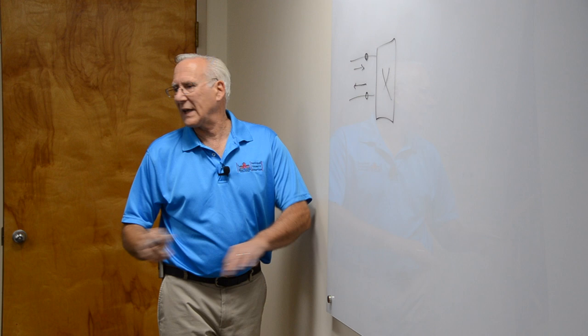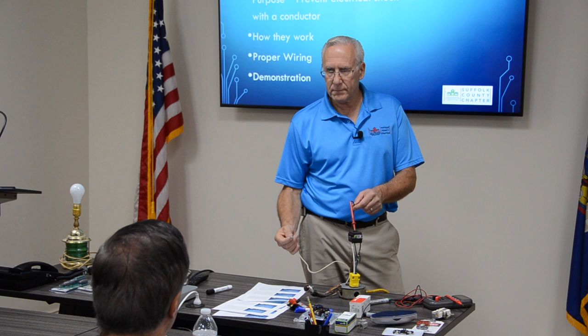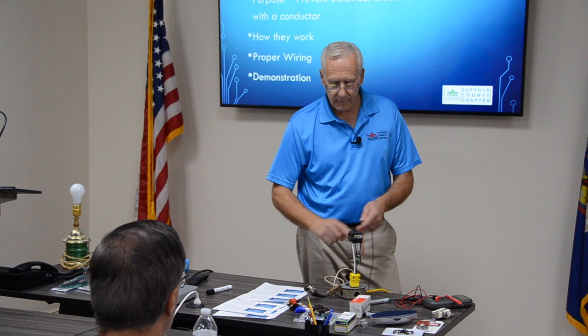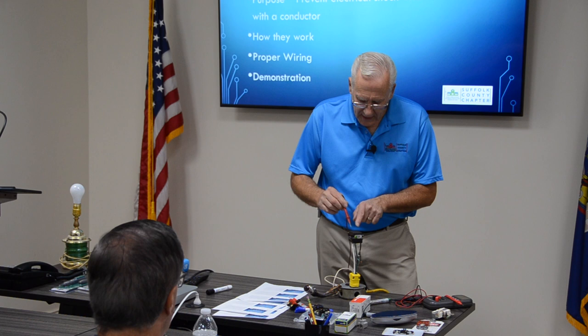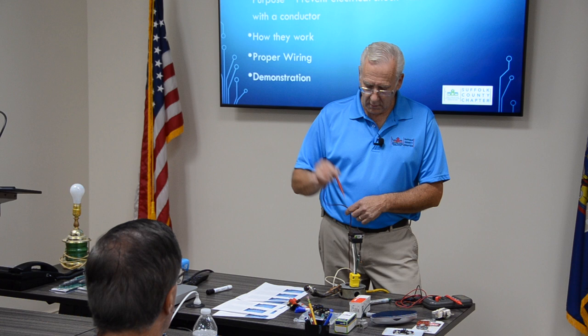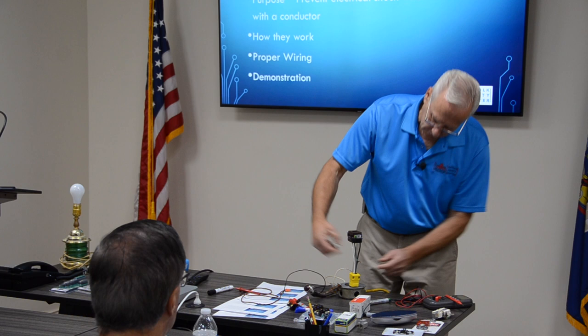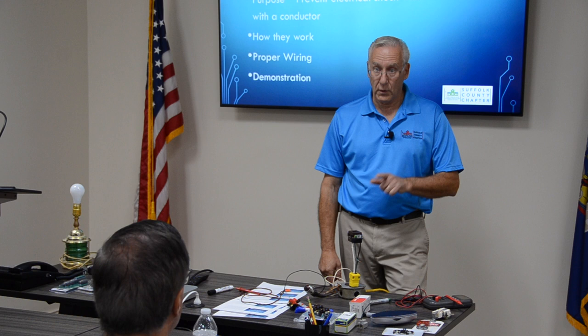So what I did is I plugged this in, and there was no neutral. Okay, you follow that? Here's the ground. So this actually is the human. This is a human being right here. Let's reset this. Now if I plugged the lamp in, obviously it would work, right? Because both would be plugged in, but I'm only taking one. Trips right away because it was unequal. You understand that? Now let's disconnect the ground. Disconnected, right? Will this ground fault work with the ground wire disconnected? We're going to find out.